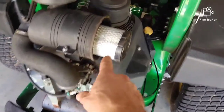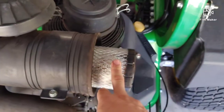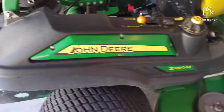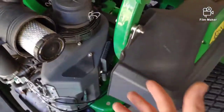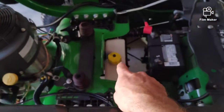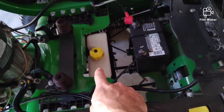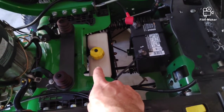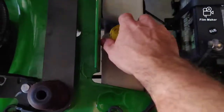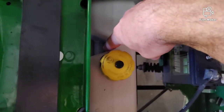I would always tell my customers: change the oil, check your fuel filter, check your air filter, grease your spindles, and you really won't have catastrophic failures. The other thing is to change your hydraulic fluid — it doesn't need to be changed until the first thousand hours, and on some units it's a little further.